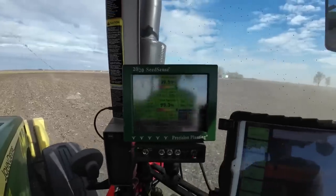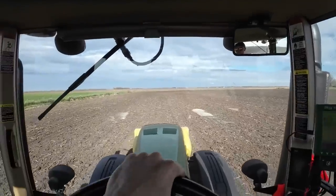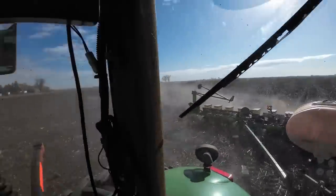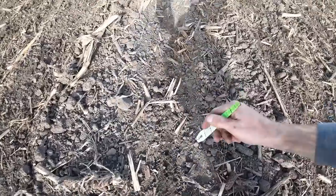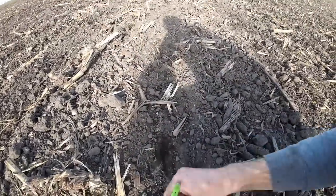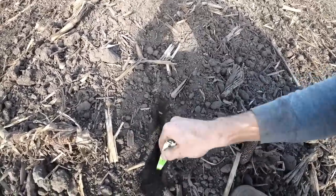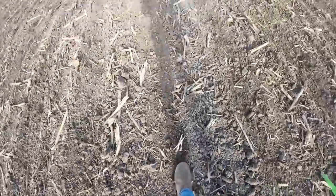Fingers crossed — it's working for now. I think everything's working — knock on wood. The whole precision screen is green. That's a good thing. We've got 10 gallons per acre on the bandit and 5 gallons per acre on the starter. The climate's working. A little bit of a sigh of relief. We're over half done with the field and I should get out and check planting depth — I forgot with everything going on. About 2 inches — that's what we like to see. Sweet.